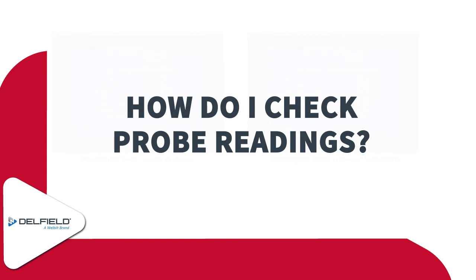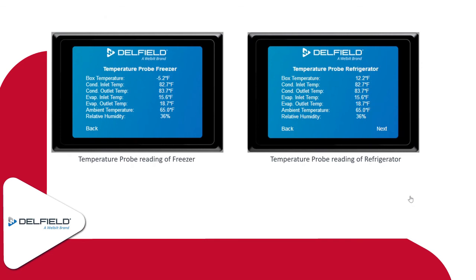How do I go about checking the probe readings when I'm working on a unit? You can go into diagnostics, and in diagnostics there's going to be a selection for checking the probe temperatures, the probe readings. Once you go there, you'll see the different readings as far as box temperature, inlet and outlet of the evaporator and condenser coils, ambient temperature, and if the customer has the humidity sensor, because that is an option, it's not a standard one, you can check the humidity in the area where the unit's located as well.